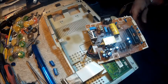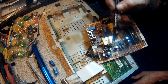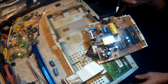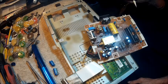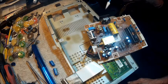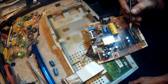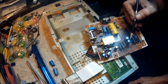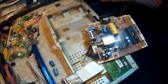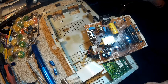The taskbar was going to the other monitor — the one that was not working. I'm betting that once I replace these five capacitors, this thing will work. There's not really a whole lot more that can be wrong with this except the capacitors. It could be a resistor, it could be a diode, it could be any number of things, but this is the obvious problem. We need to fix the obvious problem before we fix an unobvious one. If we fix this and it only costs $4.24, and we have enough to fix both monitors, that's a no-brainer.